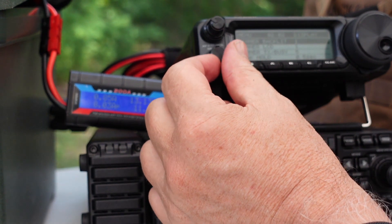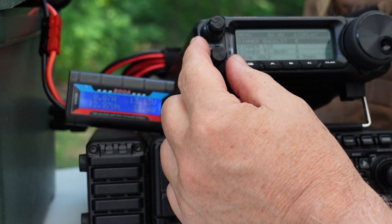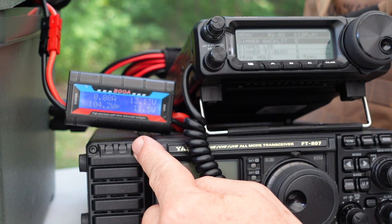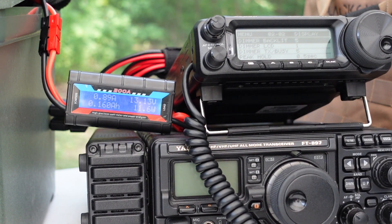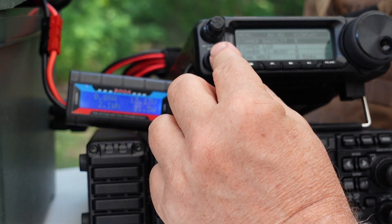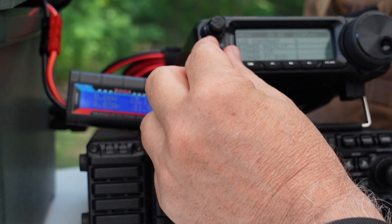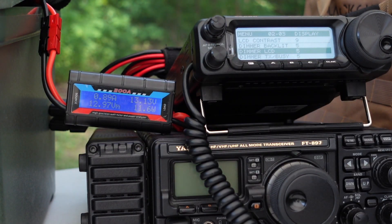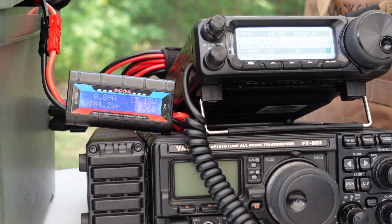Now, what you can do is scale this up a bit to where it's actually necessary. So if you like it on 5, that's great — you're still only at 0.88, which is a noticeable savings on battery life as opposed to 1 amp. I've got the LCD set at 1. Let's call the backlit at 5 — as you can see, we're still at 0.9 amps, so about 900 milliamps. We've just saved ourselves about 10%. And this is the lowest I have been able to get an FT-891 down on current draw.